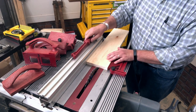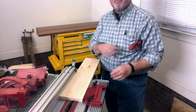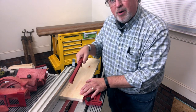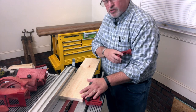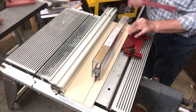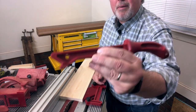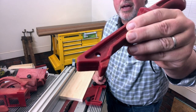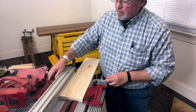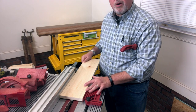I typically take the push stick and — this is going to seem weird, I'll just admit it — I stick it under my arm with the handle facing forward, because I don't want the push stick way out to the side; that's crazy talk. I don't need it until I'm up on the table making the cut. So the push stick goes here under my arm. I begin the cut; after the board is up on the table I don't stop pushing forward — I continue pushing as I reach for the push stick and push it on through. This push stick has also come into contact with the blade at some point, and I'm assuming that saved somebody's finger.